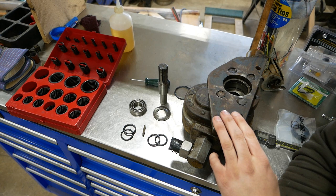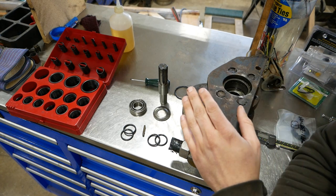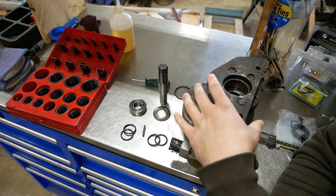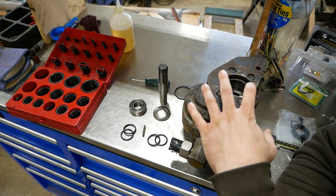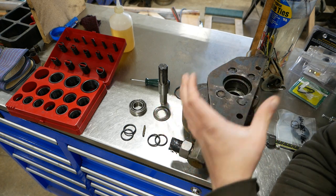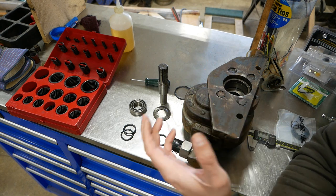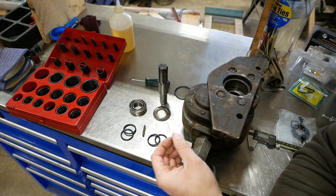Next up is the hydraulic pump. This is a commercial brand gear pump. I'm positive that it's not original to the machine. Somebody made this bracket to adapt it. It's just been torch cut out of some plate, and then they've ground the heads of the bolts off for clearance. Whatever pump they had originally would have just bolted directly to the front of the machine without this bracket. I think it works. At least, I would be surprised if it doesn't work.